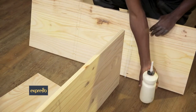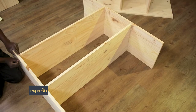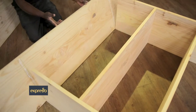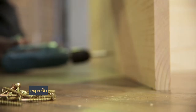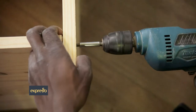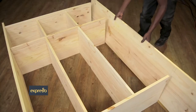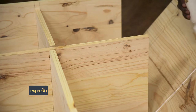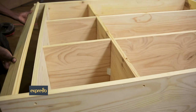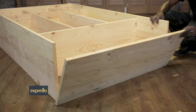It is very important that you line the panels up according to your pencil marks. To install the verticals, start with the longer top verticals, and then move down to the bottom verticals. Do the entire one side before proceeding to the other. Then screw on the top and the kick plate strip last. Use corner blocks to fasten them in place easily.